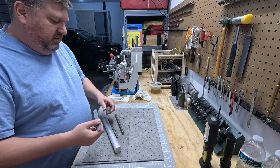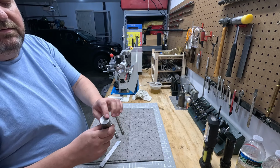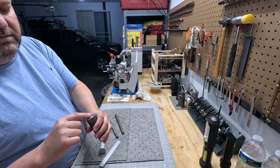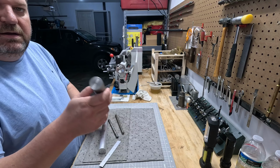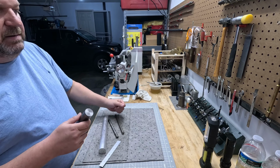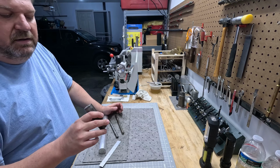I'm going to start again with using this material. First thing I want to do is face it off clean. I want this to be perfectly flat. It's a pretty rough material, rough face right now. I'm going to work on this, and if it doesn't improve with some carbide inserts or different cutting material, right now I was using high-speed steel, then I'm going to switch.